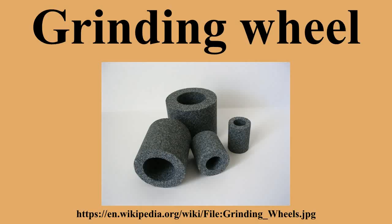Grinding wheels are consumables, although the lifespan can vary widely depending on the use case, from less than a day to many years. As the wheel cuts, it periodically releases individual grains of abrasive, typically because they grow dull and the increased drag pulls them out of the bond. Fresh grains are exposed in this wear process, which begins the next cycle. The rate of wear in this process is usually very predictable for a given application, and is necessary for good performance.